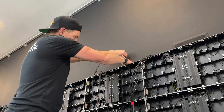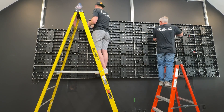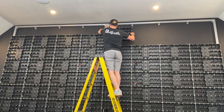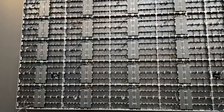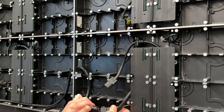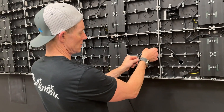Route the network cables feeding your video from the LED controller to specific sections of your wall according to the resolution and our provided network and power diagram. After all the cabinets are installed, connect each cabinet's power and network to each other based on our network and power diagram.